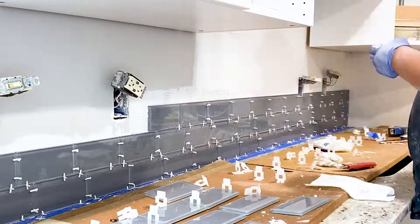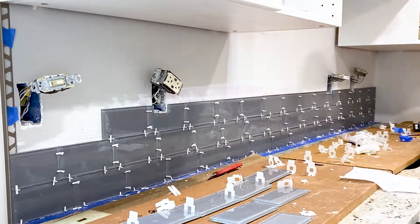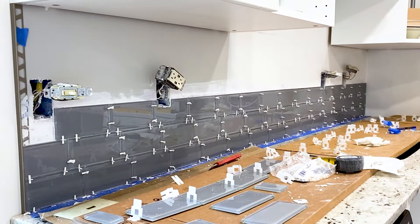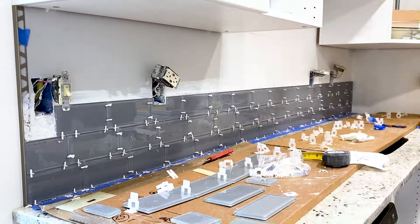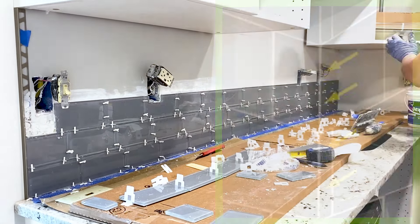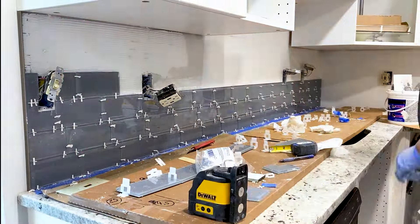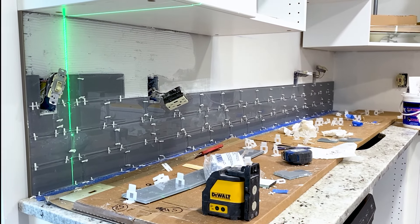You may have noticed that we switched sides and are now laying tile from the corner out. This is to make sure we have a good layout in the corner, and it's a lot easier to cut smaller slivers around the switch at the end than to take a chance on guessing what size tile to cut on the side of the switch and end up short in the corner. As we are working our way up the wall, our pattern is starting to repeat, so we are using the laser level to line up the grout lines in rows two and four to find the cut line for the next tile.